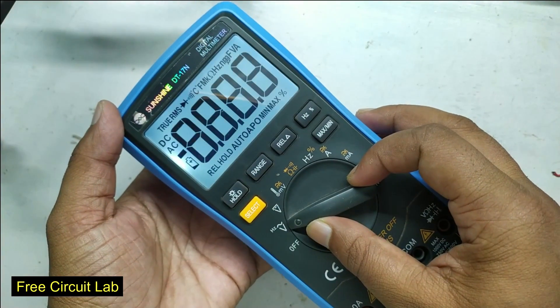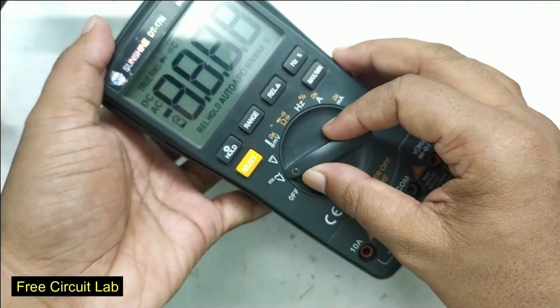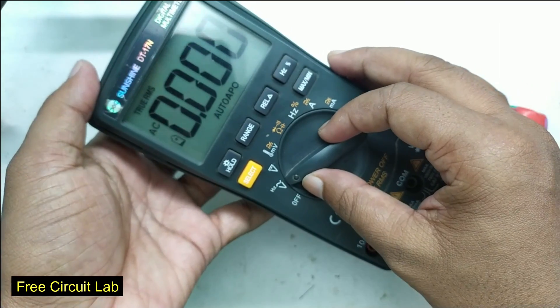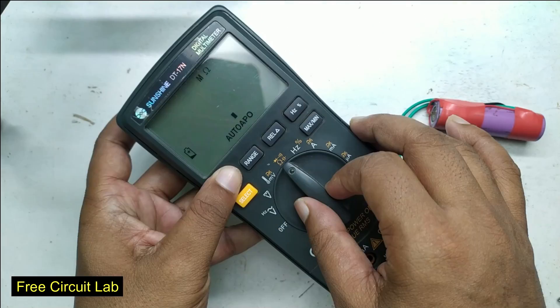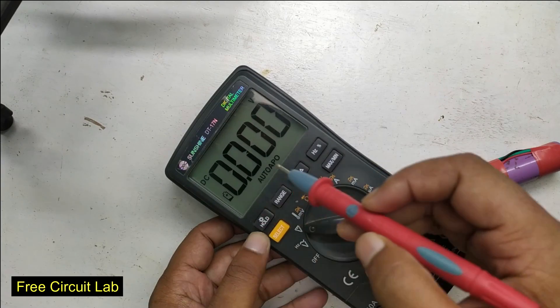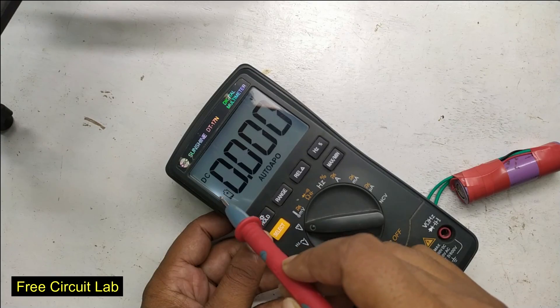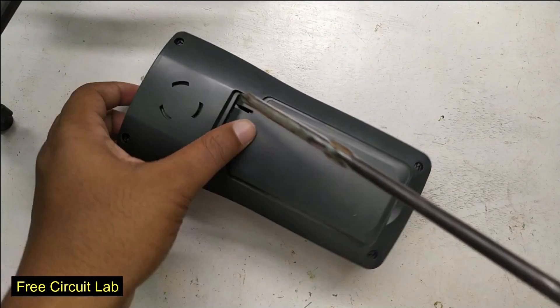So I must use a lithium battery or some kind of rechargeable battery. Out of curiosity, I hooked a lithium battery up and it works fine without any modification — no drop in accuracy, the backlight works too but a bit dim. The only problem is the low battery symbol. I have to get rid of it somehow — I have to hack it to show a little above 3 volts, which is the low threshold for a lithium battery.